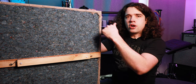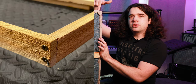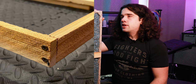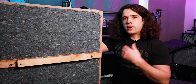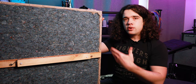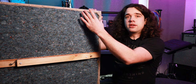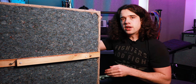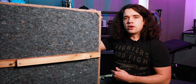My corner joints are about as rudimentary as it gets — there is a crossbar that goes across the top that I drilled into from the top and into the vertical beams, and then I just screwed the two beams together. Anytime you're drilling into your wood, make sure you always pre-drill your holes before sending your screw in, otherwise you're going to have your wood splinter and break open. Also, when I did my corners, I had some 90-degree grips that held it tightly in place so I could make sure that my screws were going in perfectly straight and the beam was going to be a perfectly 90-degree right angle for my frame.